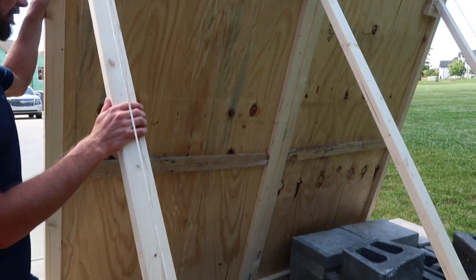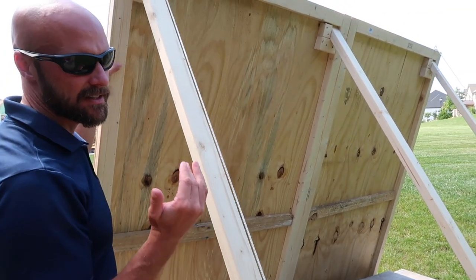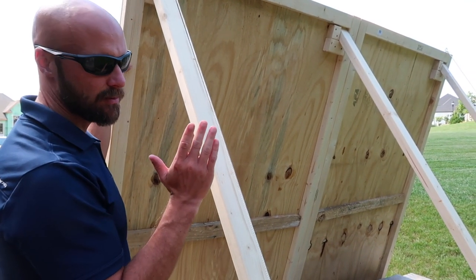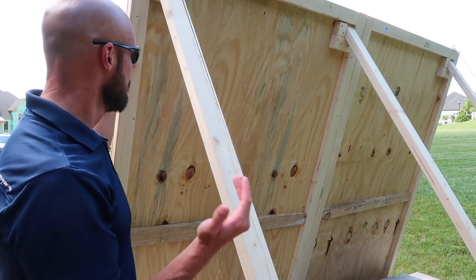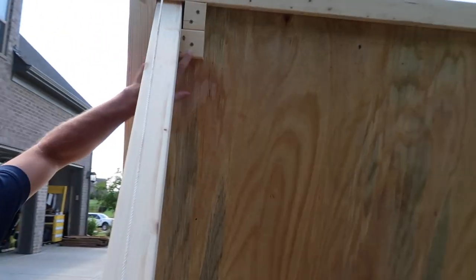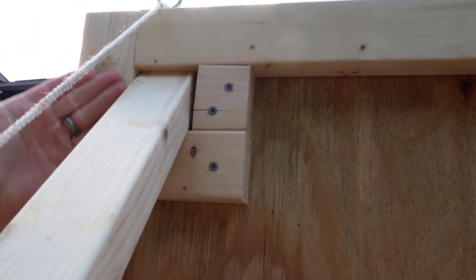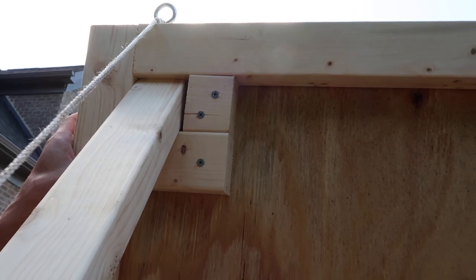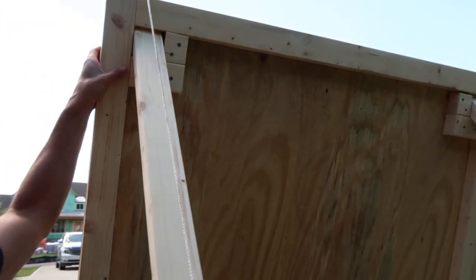And then the toughest part about building this was how should you angle it? Because technically to get a more realistic rebound, they say you should angle it just a little bit and you'll get a more realistic rebound from playing an actual opponent. So in order to do that, we basically built this in where you'd have a couple of pieces where you could actually slide in an angled cut board. So we cut this at a 35 degree angle, and then we cut the bottom at a 35 degree angle as well. And basically just made this so that when he's hitting hard against it, it won't pop out.